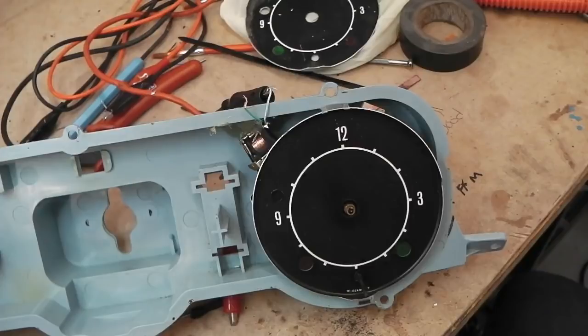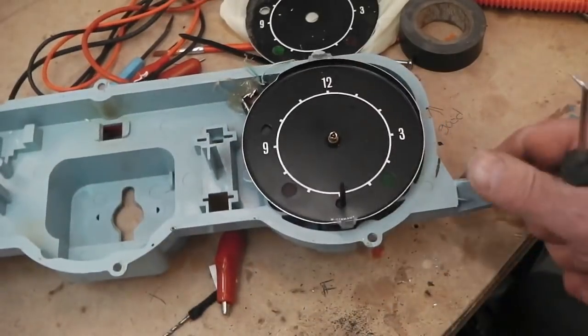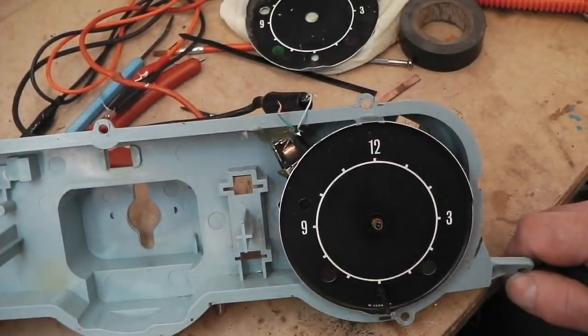I think anyway. Yeah, because my fan sensor's in the bottom of the engine, I usually fit them at the bottom, not the top of the radiator. So if you're getting into a dangerous situation or you were overheating, you'd notice that was on all the time, if you were looking for it anyway. Obviously we've got temperature warnings as well, but it's good to know.